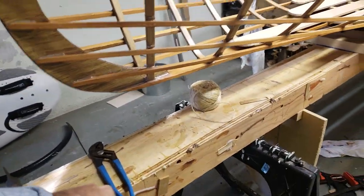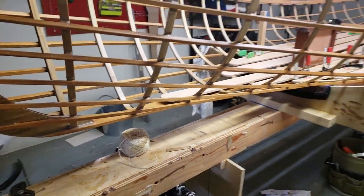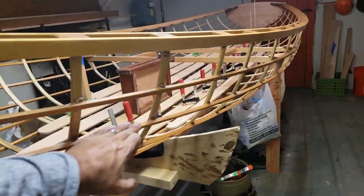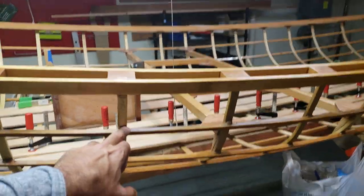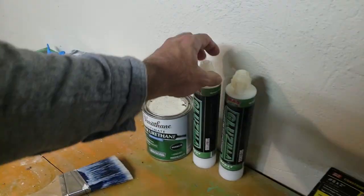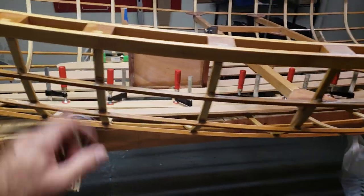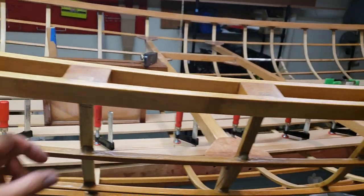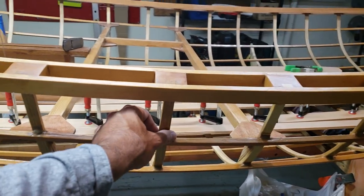As it comes out of the gun you have something you can work with — I would glue these and then take my finger and make fillets, then wipe it wherever I could. That brown stuff everywhere is from me wiping this off as we go. Every other joint between the ribs and the stringers was dot-connected with Moss Gluezilla, which is slightly different — it's thinner, like a vaseline. You just tack it together and come back later to do a fillet over it with the brown Woodzilla.